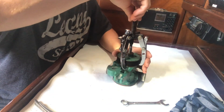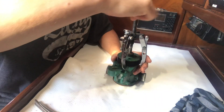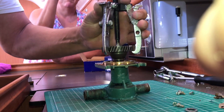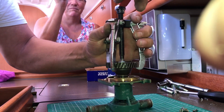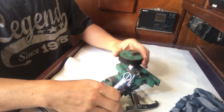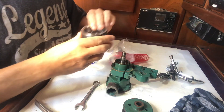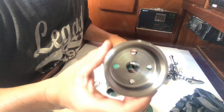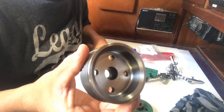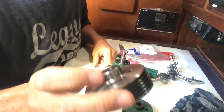You just mount the pulley remover over the pulley like so, then use a 14mm spanner. Ant was actually making a video on how to do this just as I went over to borrow his puller — and there it goes. So that was 180 euros — and the pump itself you can get from the UK for just under 300. That is an expensive bit of engineering.